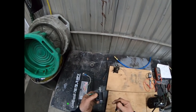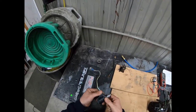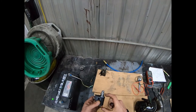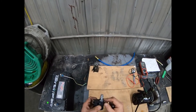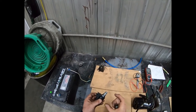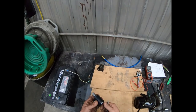If you unplug it, it'll lose its magnetic pull. Keep in mind: if this coil is making a magnetic field, that only proves the coil part is working. We also have to verify that the shuttle inside the cartridge is actually moving, because if there's dirt in there or it's damaged and the shuttle isn't moving, you'll hear the click and get 12 volts, but that doesn't mean the valve is actually working or that the shuttle is moving to divert the oil.